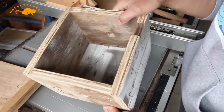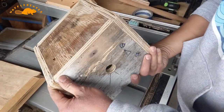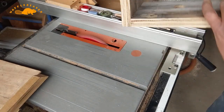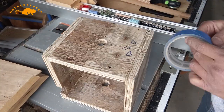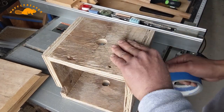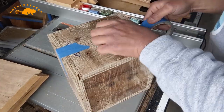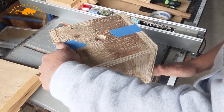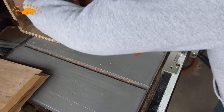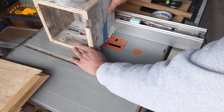This concrete mold box was quickly made with scrap plywood that I picked up while dumpster diving, just using wood screws — it wasn't perfect but it worked. The blue Sharpie line is a center line through the box, and I drilled a one-inch diameter hole with a Forstner bit to make holes on opposite sides. I cut the box in half on that center line and used blue tape to keep the spacing from the kerf on the table saw.